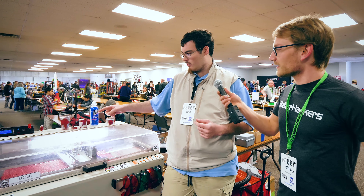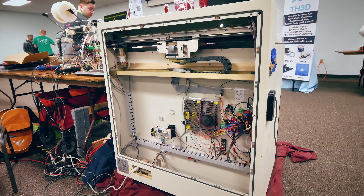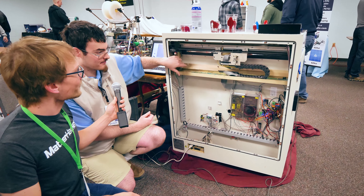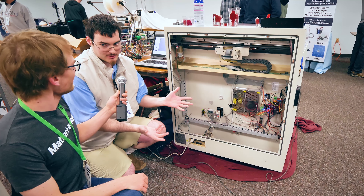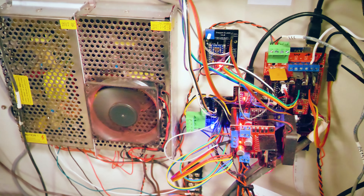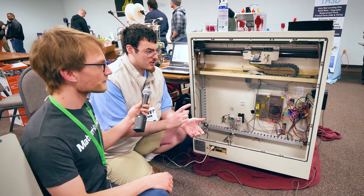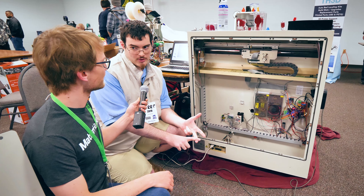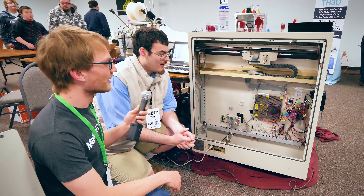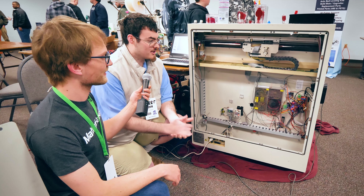Okay, let's start up here. So this is pretty empty — I see some standard RepRap stuff that looks like a RAMPS, but there's like this tower of awesomeness on it. What's going on here? So this is actually the motor up here and it's, like I said, a DC servo motor. This is a RAMPS board, a standard RepRap Arduino Mega Pololu shield. What I did — this weird stack on top of it — is a custom board I put together that uses two Arduino Pro Micros made by SparkFun. I use that to read in the step, direction, and enable pins on the motor carriages and then turns that into PWM and direction for a DC motor. So you've got a full PID loop running on this? Yep. So it's full closed loop. I've lost power on this machine before, just plugged it back in and it just continues where it was. So it's not entirely as stable as I'd like it to be — you can hear it kind of vibrate because it is bouncing back and forth — but it does work fairly well.